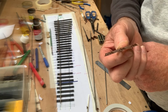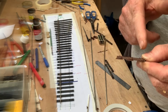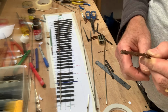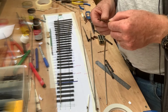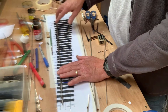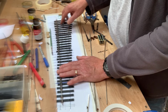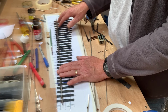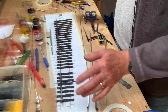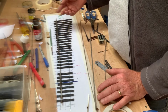Sitting there, the new C&L chairs, which got two slots in there, so you get the right gap for your check rail in there. I mean, the other way of doing it would be, and I've done that before, is leave two chairs out there, and then you put just two chairs on the actual check rail and slide in and make sure your gap is correct.